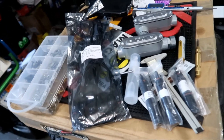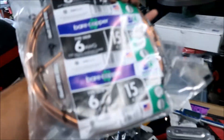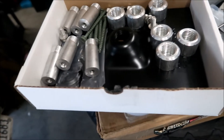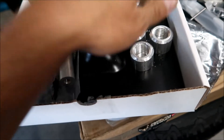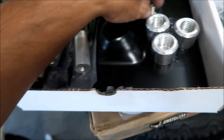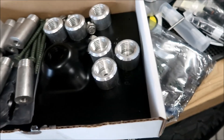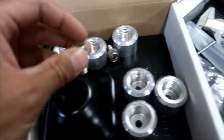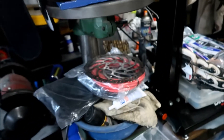Here's the wiring materials I got. I bought 15 feet of 6-gauge wire for the ground wire — I measured it and that should be fine. These are all the flashings — I got the right ones this time. There are six flashings, six fast jacks, six lag bolts, and six bolts for the rails. I'll need to check the existing installation to see if I put any washer on the fast jack, since it already has a flange.